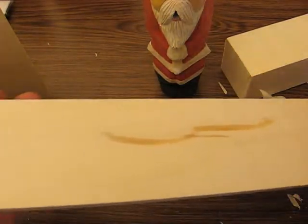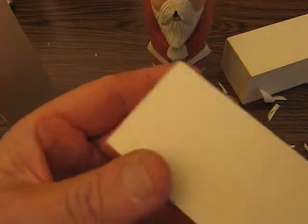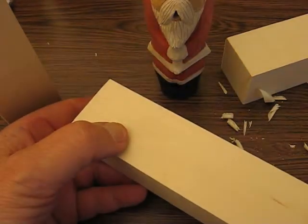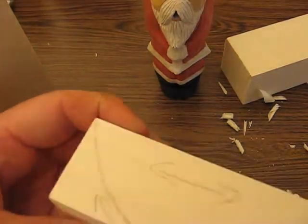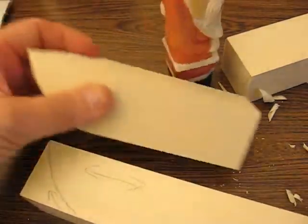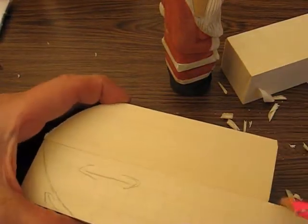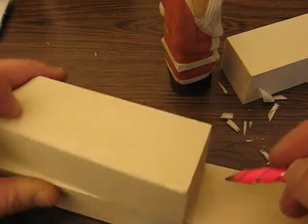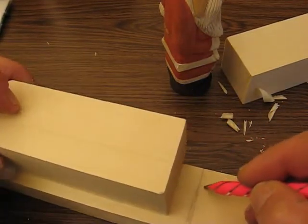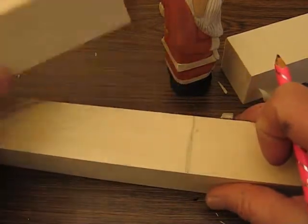This piece of wood looks longer than it is — it's only 18 inches long. I ordered them completely square from my supplier. What you want to do is get five inches tall: measure the five inches, draw a line, and cut it as straight and perfectly square as you can on a band saw.